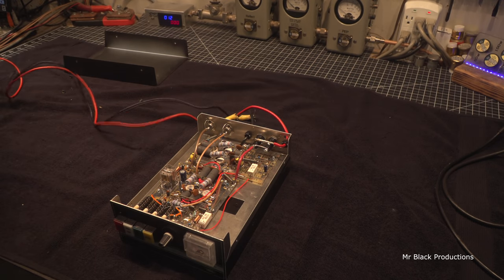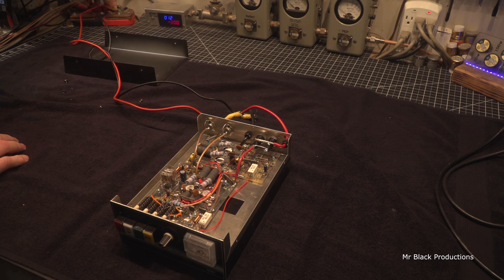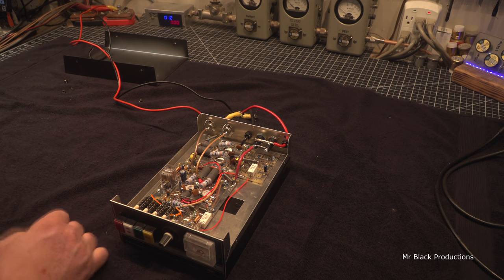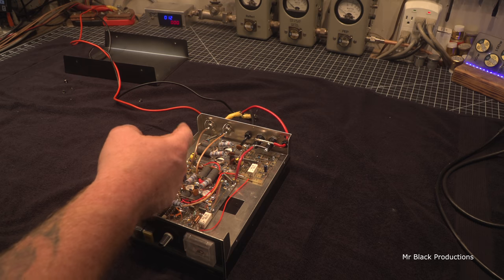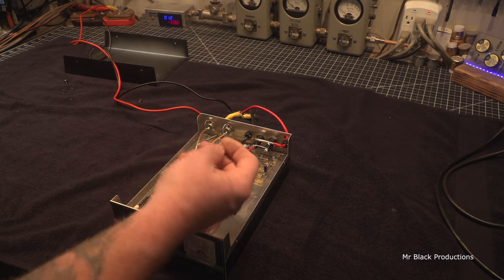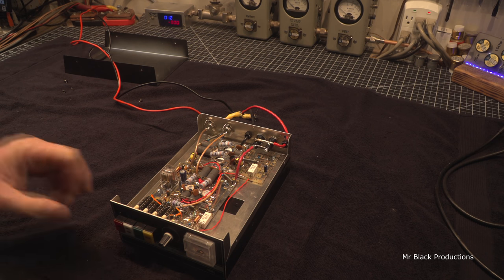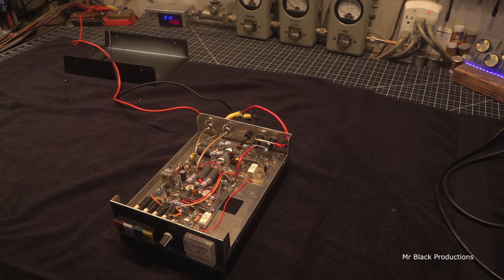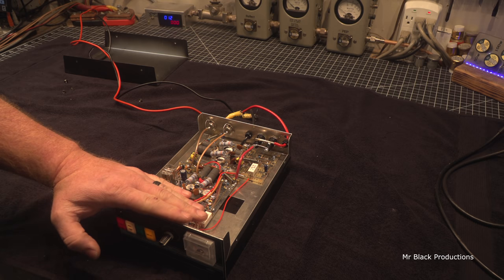Did one the other day that the cat was like, man, I don't understand. I can't talk through the amp. I can't key up, and SWR going into the amp causes it to trip. And he'd burned out, it was a sweet 16. He'd burned out six of the eight transistors. And the way the output wire from the factory was laid, it was laid right across the top of the combiner. When the combiner burned up, it literally got so hot it melted and broke the wire on the input side. So can't key up, relay's not tripping, and you can't talk through it. Come to find out, it's because six of the eight transistors went up in smoke. That would explain everything, huh?